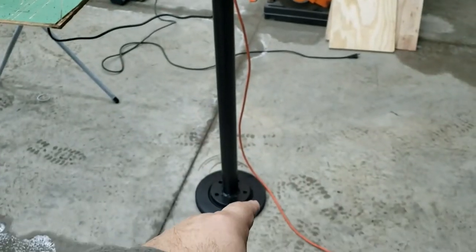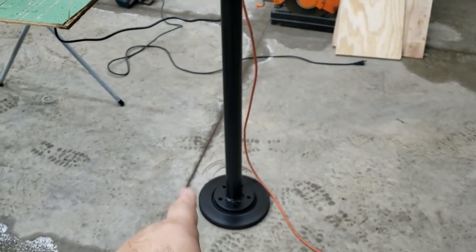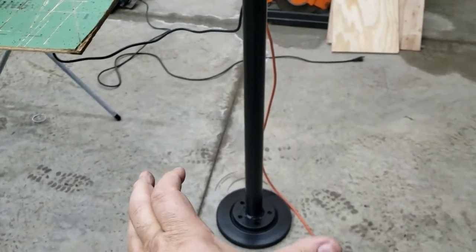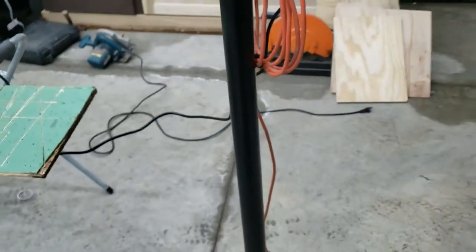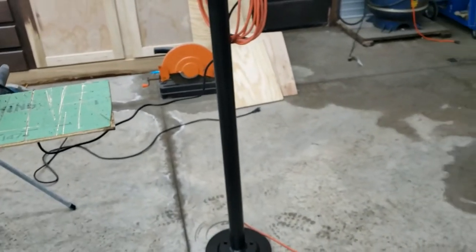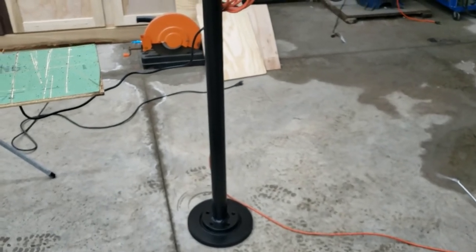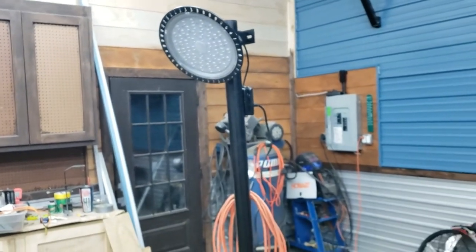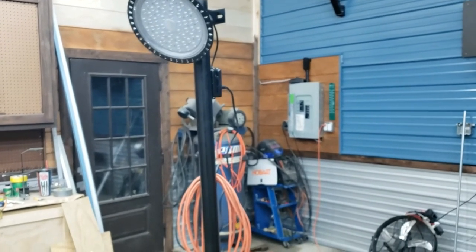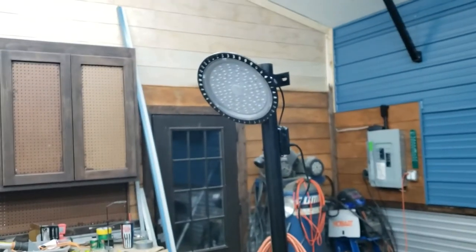You could always go by somebody's mechanic shop and find a brake disc. Get one from a truck — it'd be bigger. That one's off a little Toyota Scion. Get one a little bigger around and this thing's real stable because the pipe's real heavy. It'd also be easier for someone at home to cut with a sawzall or hacksaw. If you get the newer fence pipe from Lowe's or Home Depot it'd be really thin wall. I had this stuff laying around — I put it together in about an hour last Saturday when it was pouring rain outside.